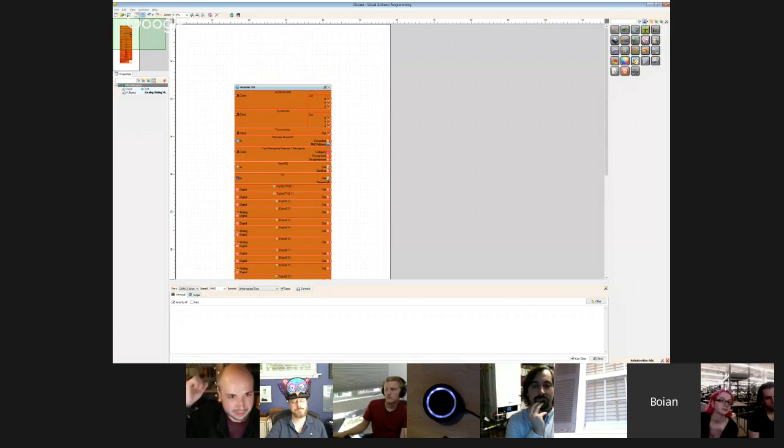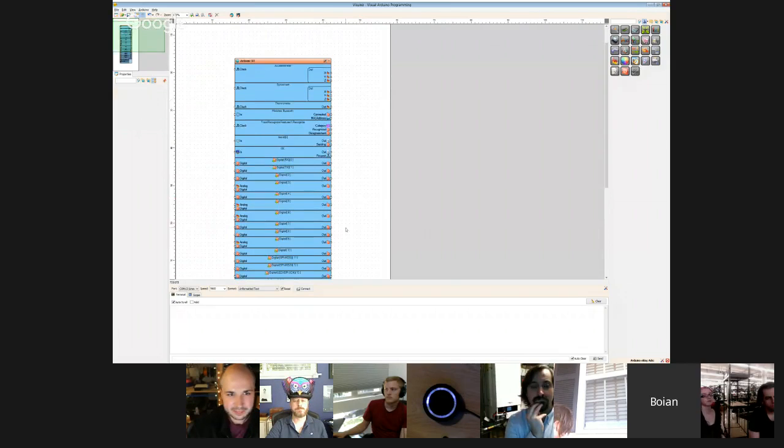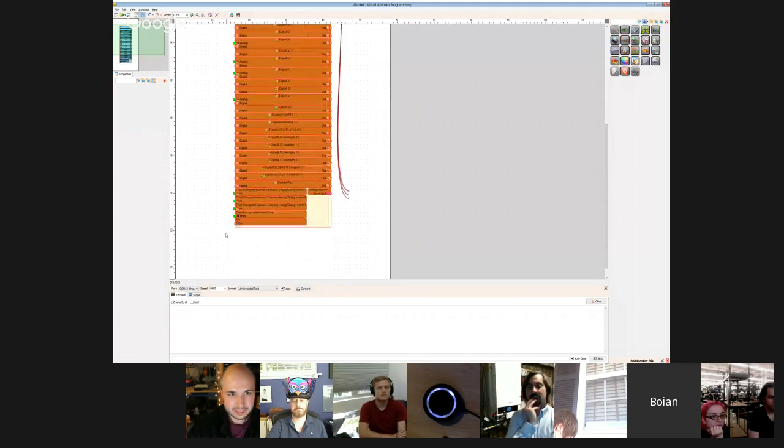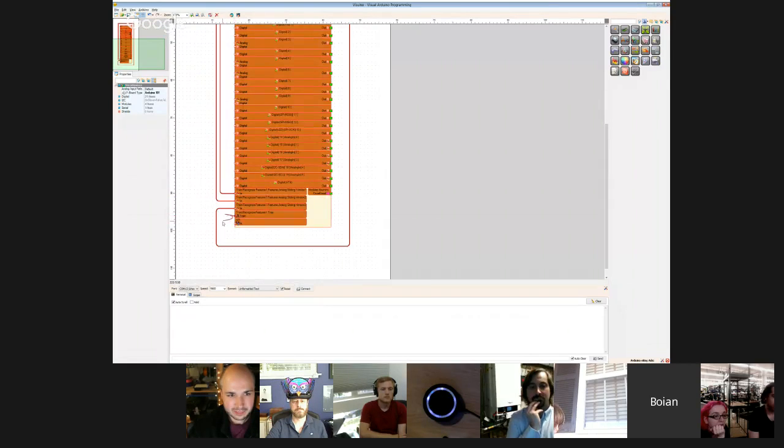So I will add 3 sliding windows features. And I will hook the accelerometer to them as example. And now I have another pin which is for training. If I connect it to one of the digital pins for clock, so basically now I can train for a gesture. I can shake the board as example, and when I click a button, in this case I selected digital pin 4, it's going to learn that particular gesture.